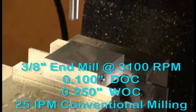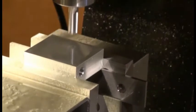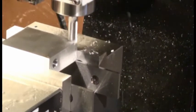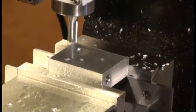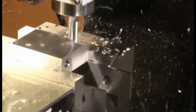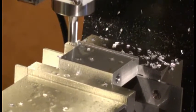This is one of the longer sections of the video — the actual machining of the majority of the features on the underside of the table pivot. We're going to create two quarter-inch ears where the hole goes through the part. Those two ears are used to secure the grinder table to a bolt that slides through. The rest of this material is just being removed to work down the size of the part itself. As we remove all this metal, we'll basically extrude those ears — they'll slowly come out.